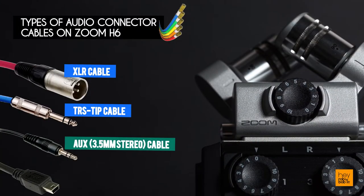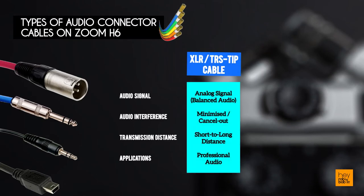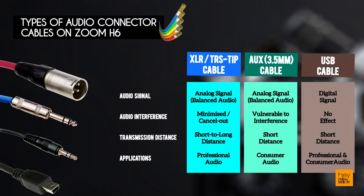There are a wide variety of audio cables in the market, and here I will touch on the ones commonly used as an industry standard for premium and general audio needs. Both the XLR and TRS are considered the premium standard, used typically in professional settings, utilizing their balanced audio capacity to cancel out most audio interference during signal transmissions across distances. The AUX, also known as the 3.5mm stereo standard, is found commonly in consumer settings due to its smaller connectors and lightweight cables, and its frequent use across short distances also helps make any audio interference highly irrelevant. Instead of the typical analog signal that most audio cables carry, the USB standard uses a digital signal which will not be affected by any audio interference.